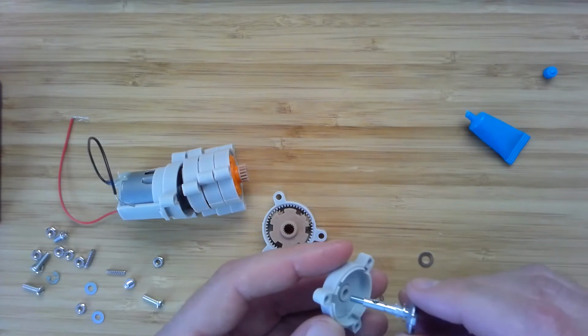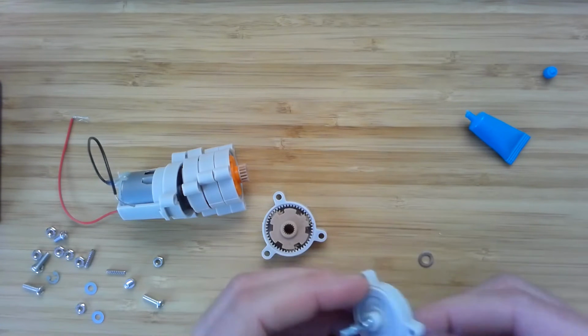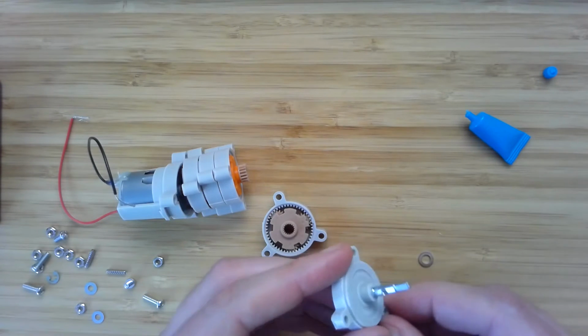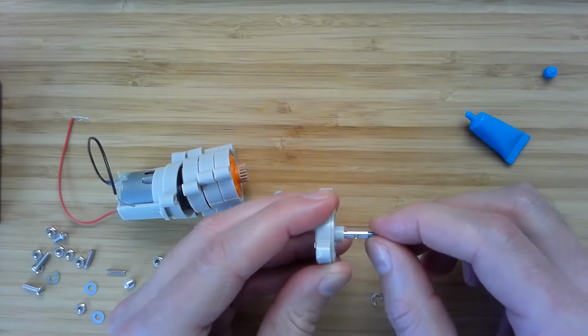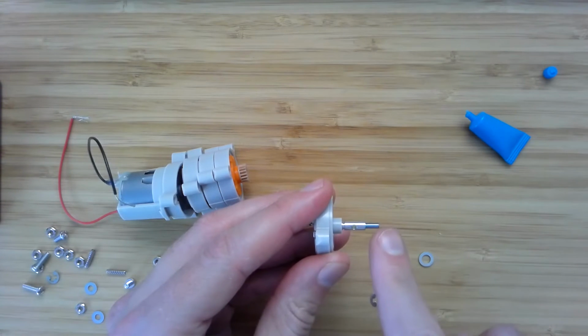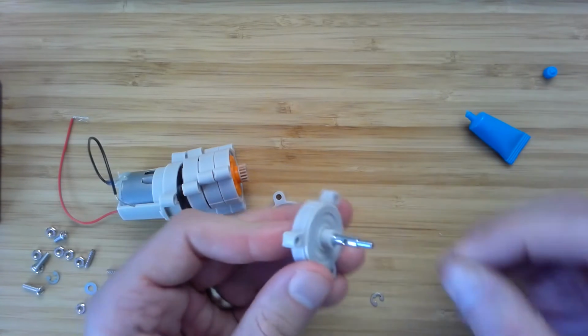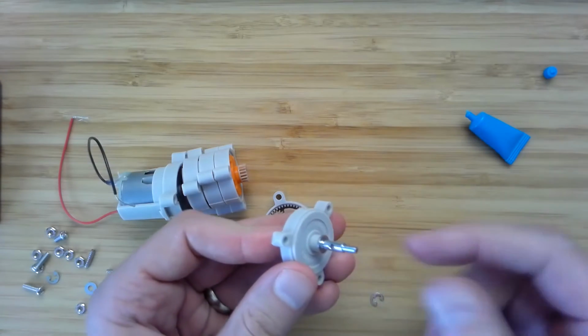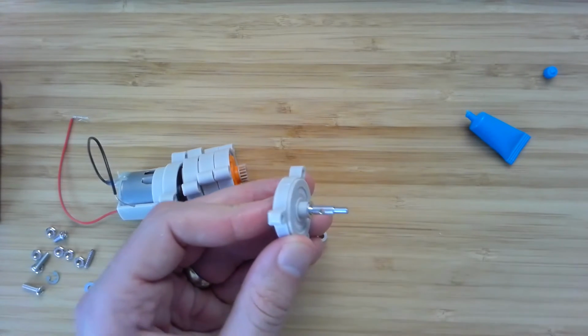And again, a nice free-body diagram of that, the interaction between this output shaft and this part of the housing, would show you that you've got potentially a very large force multiplier because of a radial load out here and the shorter lever arm between those two contact points of the housing on the shaft.